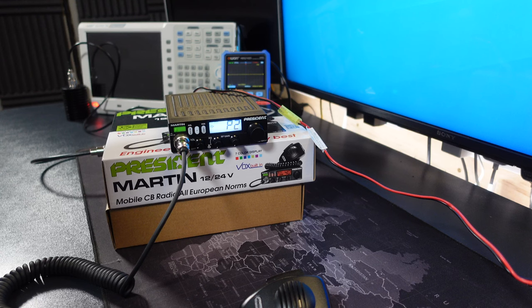We have R1, and R1 is the S meter adjustment. Mine is set to 37, and this should be adjusted with an S meter to a value of approximately 3 on the needle. SE is the software version. In standard mode it will show as S, and in expanded mode as SE. Either way, 1.0 is the value on my unit. And then back to P2.